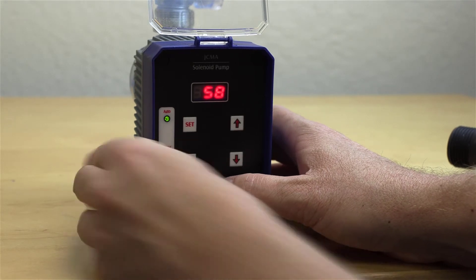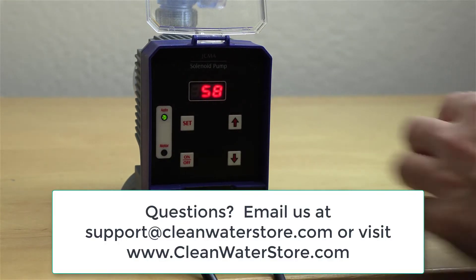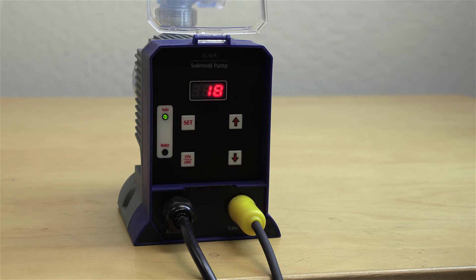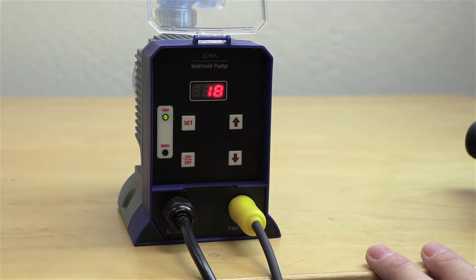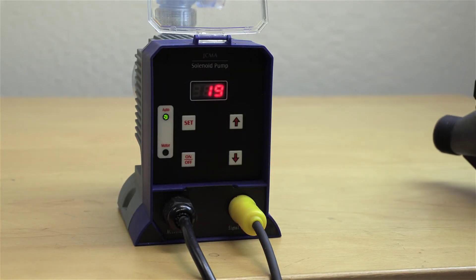Press set and the up arrow — I'm currently at four kachunks. Now I'm going to put it down to two. Taking it off standby again and simulating water — now you'll only hear it go kachunk twice. The lower the flow of water going through, the lower the digit displayed; the faster the water goes through, the higher the digit displayed. But it's always going to show that random digit. That was the meter slowing down. That's it, thanks folks.